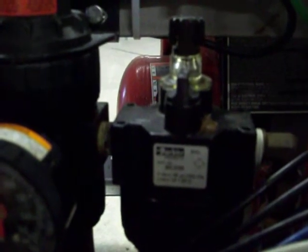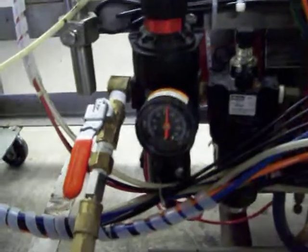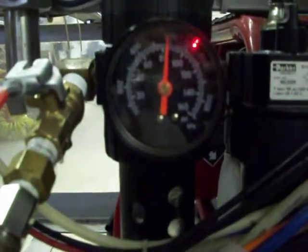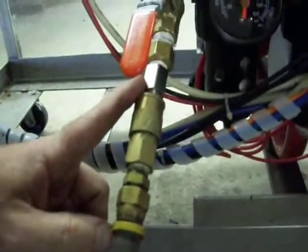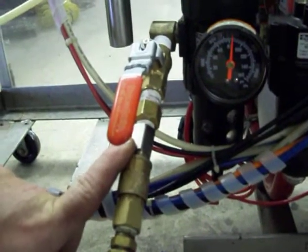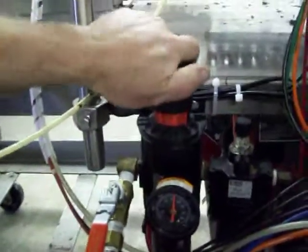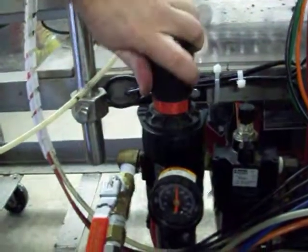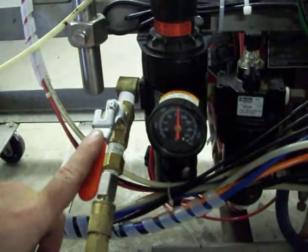You also need oil in your oiler, which is right here. With the machine turned off, remove the fill cap and fill it up with oil — air tool oil or lightweight hydraulic oil, which is AW22. The operating pressure of the machine is 80 PSI, shown on your main gauge. When you introduce your airline to the machine, you want a minimum three-eighth inch airline connected at the FRL. Pull up on the handle to adjust and regulate pressure. But again, it's 80 PSI, and this is your on/off for the machine air pressure.